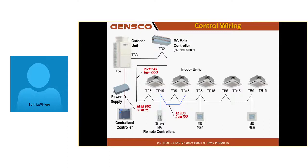And you asked about the secret code. I was looking at the thermostat. So these ME stats have 2 access codes for different functions. If you want to lock the screen, the access code is 4 zeros by default, and you can change that. The service access is 4 nines, and you can even change that.